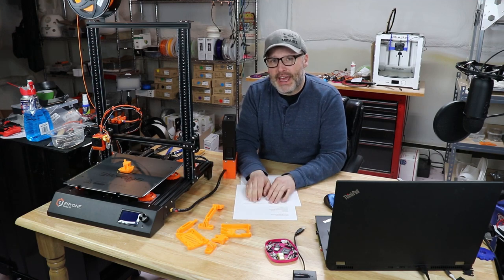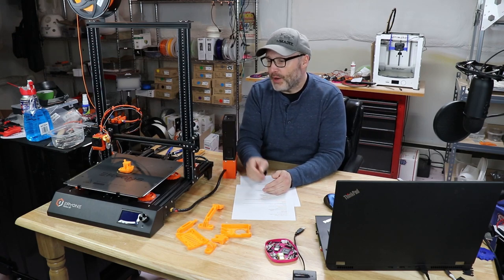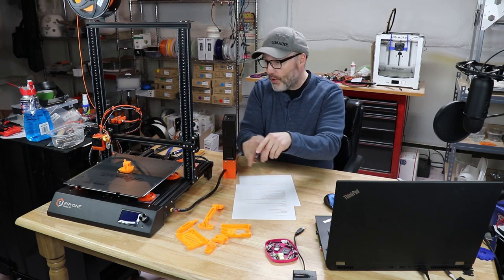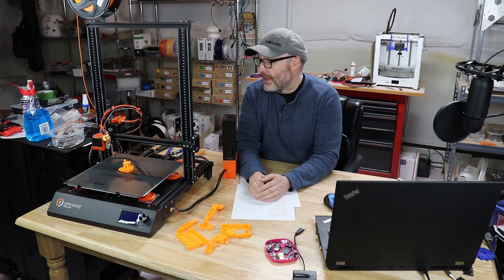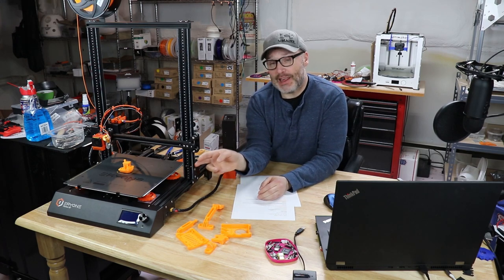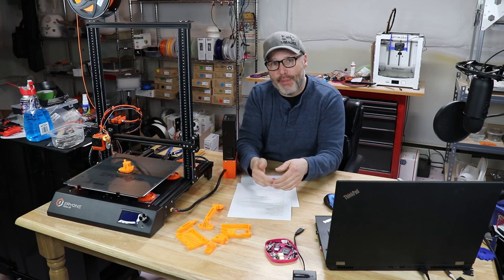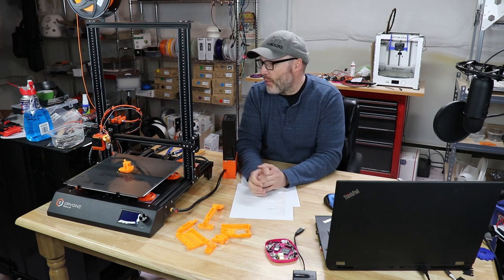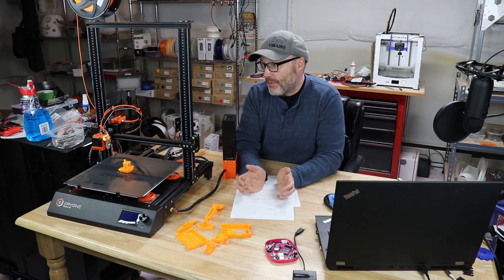Before you print, you have to level the bed. I found that with this printer, as with my CR-10S's, when doing manual bed leveling each edge is no problem, but the middle was off a little bit. The workaround is to crank the dials on the outside and bring the center up when that first layer starts. The bed surface isn't bad. The next model up is the Thinker S, which has a spring steel PEI bed in place of the glass; you can also get those aftermarket — Easyplate, Wham Bam, or various other vendors. The bed leveling being a little wonky prompted me to jump into the BL Touch, and that worked very, very well. Once I had my offsets, it's been perfectly fine ever since.